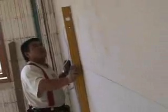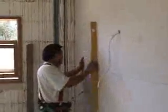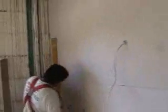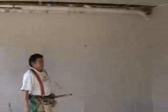And you end up with a perfectly plumb plasterboard wall. Now, by putting the sheets on horizontally like this, in full size, there's only the one joint there that has to be set and sanded. And note how there's no screw holes, so there's no setting and sanding of any screw holes. So the sheets, when they're painted, actually look far, far better.